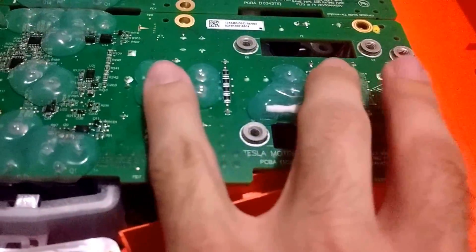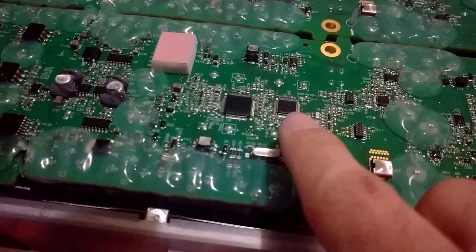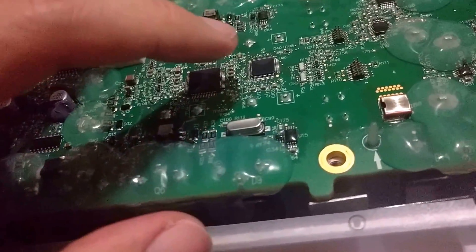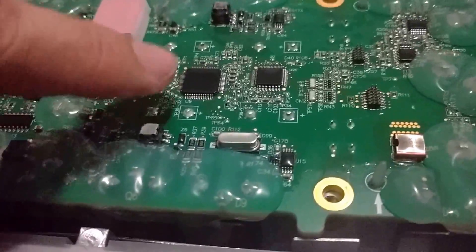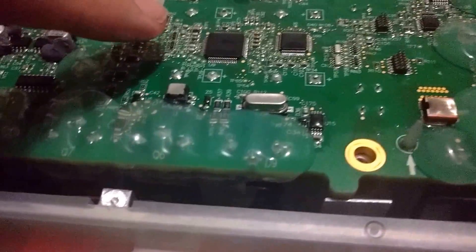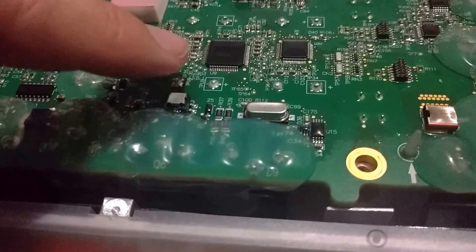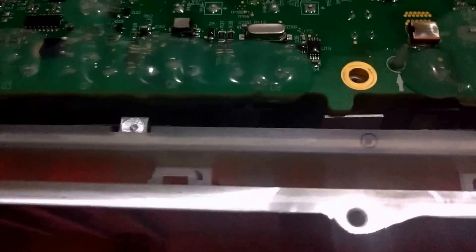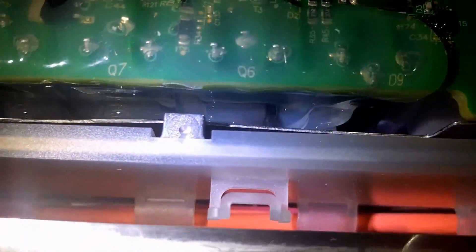These two giant soldering points are for inductors, and all the phases are the same. They have an Altera FPGA — I think it's a Max 10. Apparently my cell phone keeps crashing. It has an Altera Max 10 FPGA, and then I think it's a TMS320 DSP. Usually the code for that would turn on and off the transistors all around the border — those things you see under there are the MOSFETs or transistors it's using, on both sides. They are connected to some sort of metal backplate for cooling purposes, and I also assume this plastic channel you're seeing here is a water-cooled loop used to transmit the heat downwards onto the water backplate.